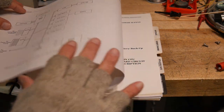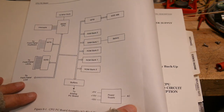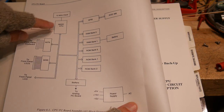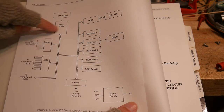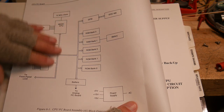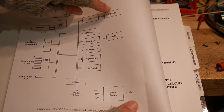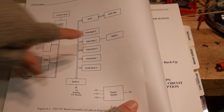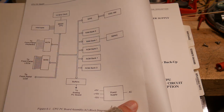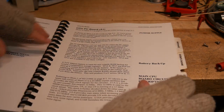Here's a block diagram of the CPU — a 68000 at 12 MHz clock with interrupts, keyboard controller, front panel LEDs, front panel LCD on the bus, banks of ROM and RAM, GPIB out to the IEEE 488, battery backup for bank one of the RAM, buffers out to the analog board, and a power supply. Pretty straightforward.